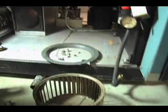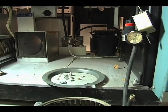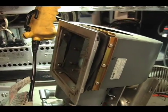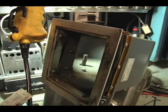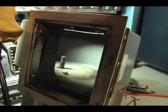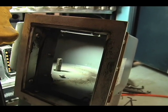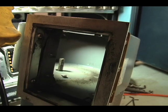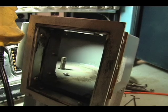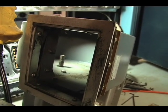Here's the squirrel cage blower and the little nest where it sits. This right here is the ductwork that goes up into the plenum for the electronic modules for cooling. It has an airflow sensor micro-switch that, if there's no airflow from this cooling blower, puts the machine in stop. So I was not going to get very far without cooling air. I hope to have this other motor in within an hour or so, and we'll try to repower it again.